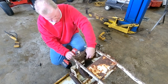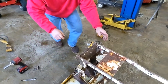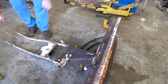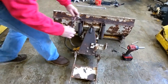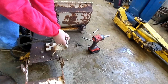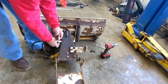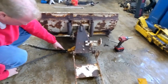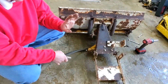Let's tighten it up. All right — and right there you have a factory blade. Usually if you have like a 1811 or 1820, you put your hydraulics on like this. Now if you have a large frame, you're going to put them on this side — usually they ran them on the left side instead of the right. One hose I made 24 inches in length; the longer hose is 26. And that will give you plenty of length.